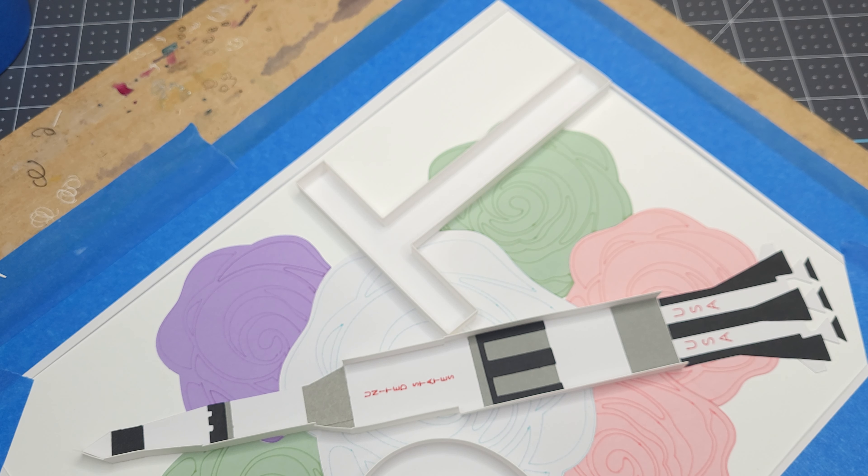I want to tuck that up tight and push it against that so it seals perfectly, holding pressure on it. Next piece — exact same technique. We're going to come down here, find where the bend is, gently bend it where it's supposed to bend, fit it back in to make sure we've got the right angle — which we did — then come down to the end and cut. That's perfect. Everything worked out very well; no remeasuring or recutting so far.